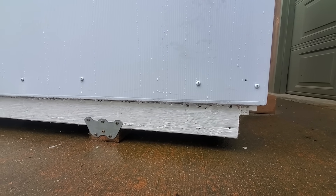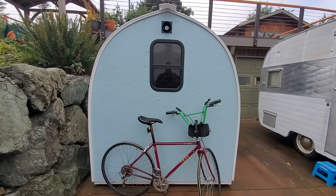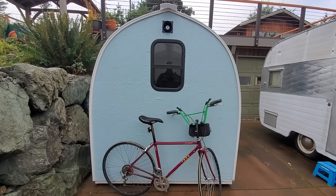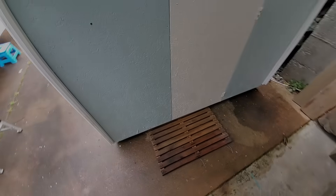Here you can see the plastic that caps the panels at the bottom — this helps insulate the panels by trapping the air inside. I used big bookshelf brackets with one-by-four boards to support a two-by-eight half-sheet of fluted plastic. Another one can be added to the back — for a homeless person in transition who normally has a bicycle, it's a good way to keep it dry. For the eave cap, I had some four millimeter fluted plastic kicking around and screwed that down into the beams.